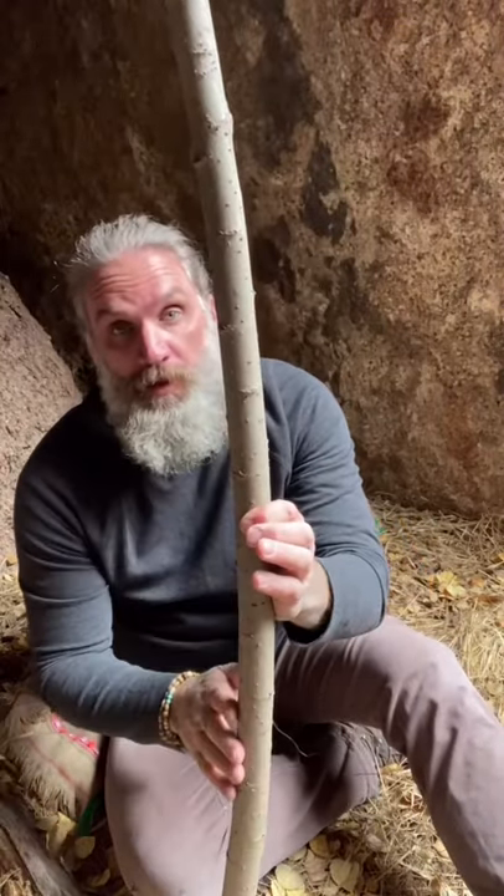So it's been about 28 days. It's not 100% dry, but it's gonna have to do. This is gonna be the back of my bow, and this is gonna be the belly of my bow. I don't ever want to take any wood from the back of the bow — I take wood from the belly of the bow.